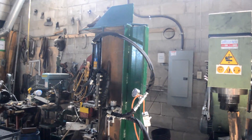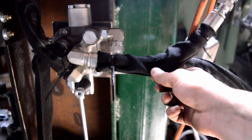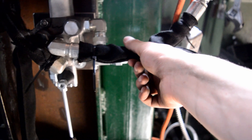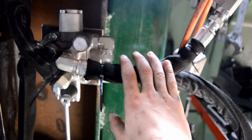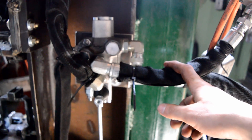If you're doing something like this, measure everything properly and familiarize yourself with exactly what you need, otherwise you're going to spend money. What I bought was this protective hose sleeve — it's supposed to help against leaks and also against hot steel. It doesn't cost much; it's less than a dollar a foot, so it's not much for good insurance. The hoses themselves I got on sale at about $2 a foot, and they're 5,100 PSI rated hoses.